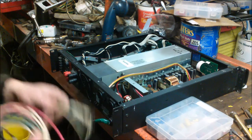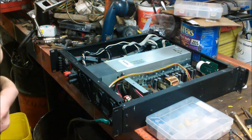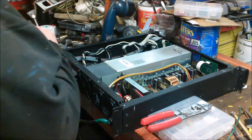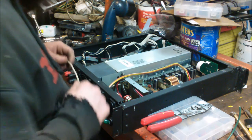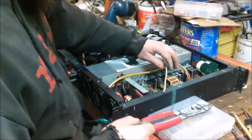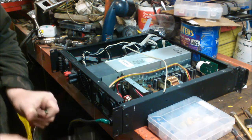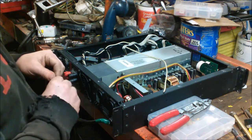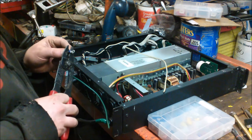I don't suppose the motorhome will miss this bit of wire. It is 12 gauge, 600 volt — good stuff. I'm going to make the closer one first. In this case, white is going to become red, green is going to become black, black is going to become black.